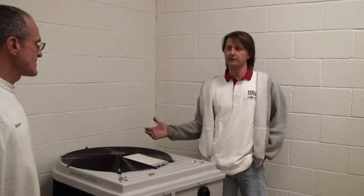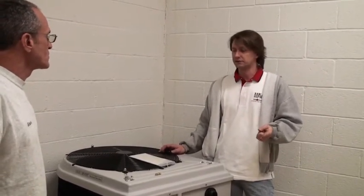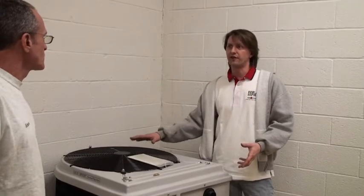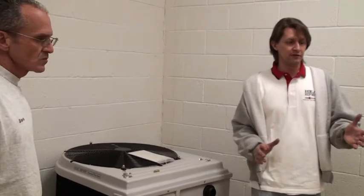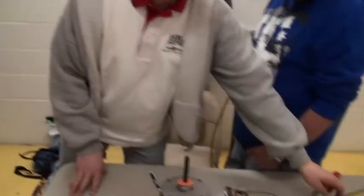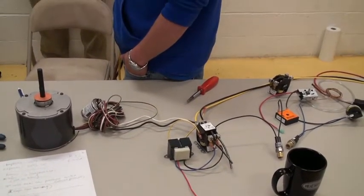Runs without heat is one of my easier symptoms to diagnose because that's compressor-related specifically. Fan is on — that means all of the 24-volt is telling you to run, so all of those switches are okay. Refrigerant is enough to activate the switches, the unit actually tried to turn on, the fan is running, just the compressor isn't. You've narrowed yourself all the way down to these wires out to the plug and the running capacitor, which is the most likely problem. Runs without heat — I've got the running capacitor before I can get out of the truck.